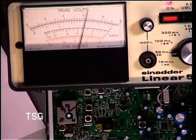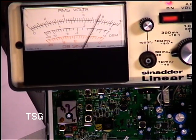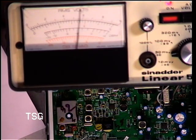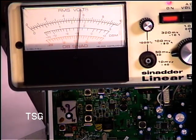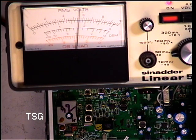That's 0.3 of a microvolt, 0.25, 0.2, 0.17. So the sensitivity is up there with some of the sets of yesteryear — that's good. The trouble with a lot of digital sets is they generate so much internal noise from the CPUs that they just haven't got the sensitivity which is usable that older sets have.